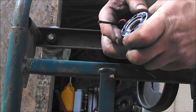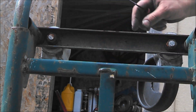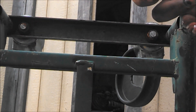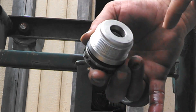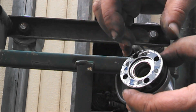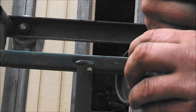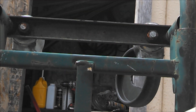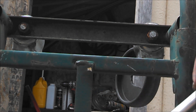Looks pretty good. That's it for the end cap. Next we're going to show you how to do the piston. Now to put the rest of this together — this is all assembled, O-rings are all in place in the grooves, continuity ring, O-ring out here, the outer seal, scraper ring. Put a little oil to lube up the O-rings. This goes on the shaft — give it a little twist as it goes in.